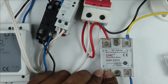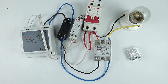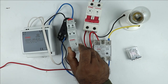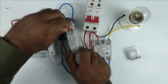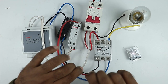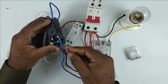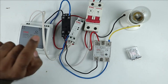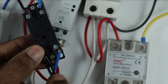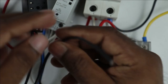Take the wire and connect it with the positive terminal of the SSR. From the black wire we get negative power supply, so I will connect that wire with the negative terminal. Terminal 4 is for negative power supply and terminal 3 is for positive power supply. Now, to turn on and off this relay through the Wi-Fi controller, at the output terminal of the Wi-Fi controller 'NO' is written — from the NO terminal you get phase supply, so connect a wire directly there. Take the other end of this wire and provide phase supply to the relay coil. Connect this wire with the coil terminals of this relay. To control this relay we also have to provide neutral power supply, so I am connecting that wire to the relay coil as well.